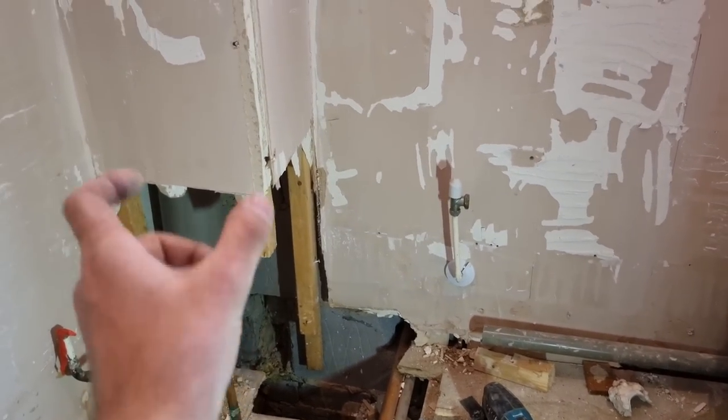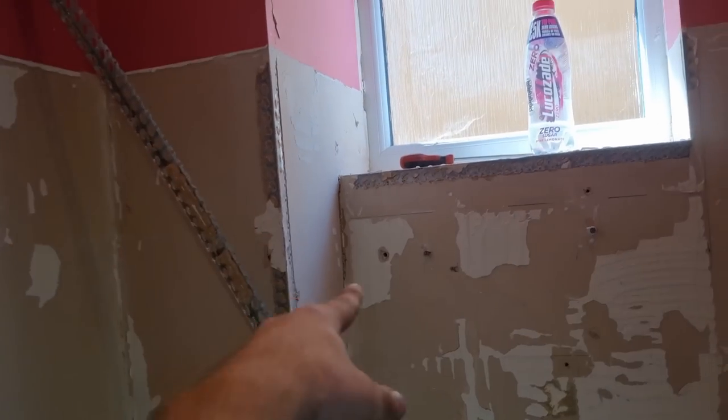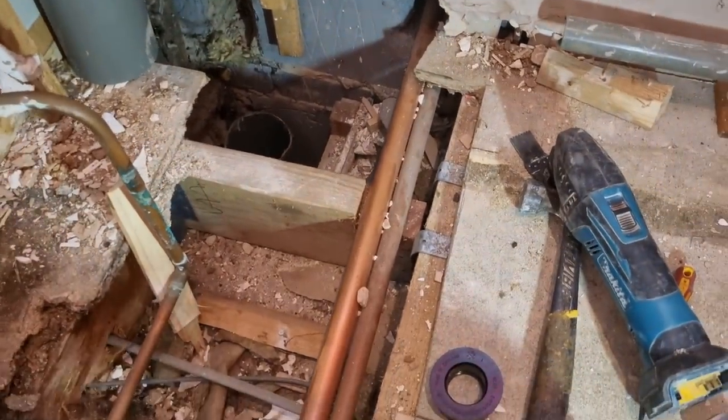I think that's just on a durgo in the roof. If I was building the house, I'd have probably done it with a full stack, but it depends how many down the road are vented. Normally you only have to vent one in three, and this one's never been a problem, so I can't ever see it being a problem now if it's been up for sort of 25 years.